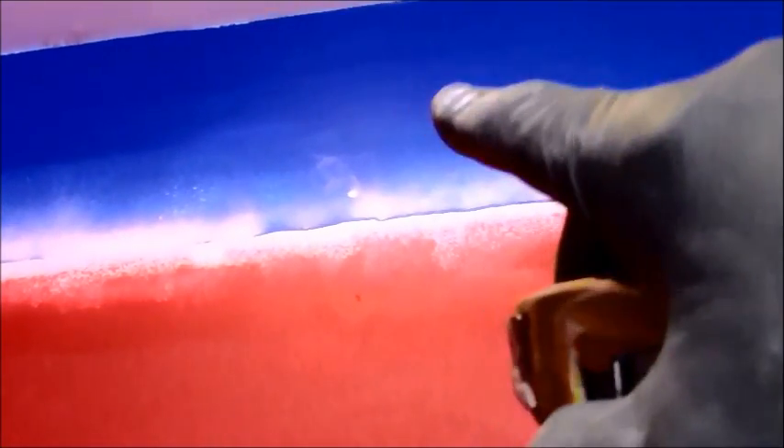Before I start, I want to get into a couple of things. This tile is 11 and three-quarters inches. I did my math all the way up to the top, and by the time you add in grout lines I have about eight to eight and a half inches for that top tile — that's pretty good girth. So I don't have to do anything as far as putting a ledger board. Normally on a shower I'll put a ledger board, just a quality piece of one-by, pre-drill some holes, and put it up.